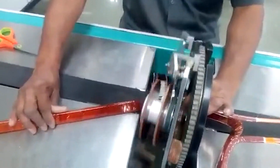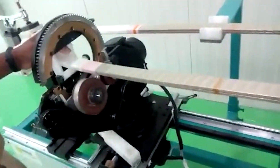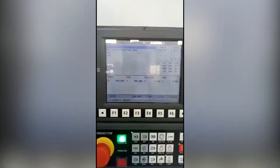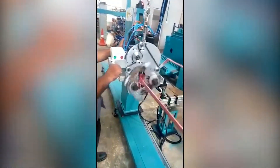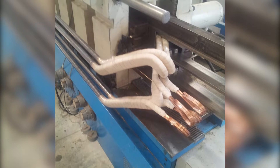The machine can form high-quality diamond coils of great consistency. The coil taping machine can be used for precise and fast application of tape insulation systems for motor and generator bars and coils, and can also tape overhang portions. Half coil, wave coil, and diamond coils can be taped precisely. This machine is semi-automatic, with the taping head suspended from an overhead track, providing consistent taping guided by an operator.